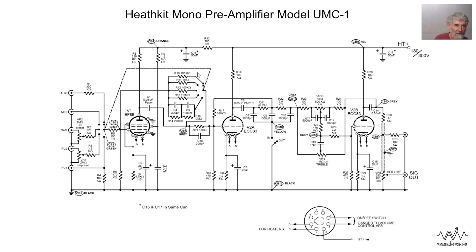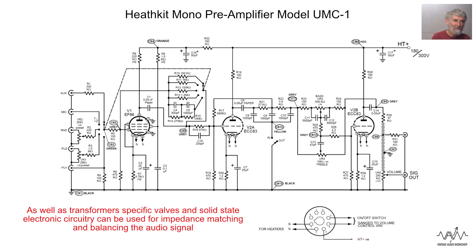One would have low gain for the radio input, but for a microphone input it might well be at a low level and one needs plenty of gain - it depends what microphone they're designing it for. For someone using this at home, they're probably using a microphone that's already got a transformer built in. There is no transformer here, so if you put a 200 or 600 ohm microphone in, one might find the volume has to be turned up full and the preamp is rather noisy. So that's the equalization section.